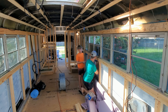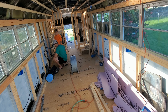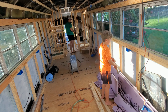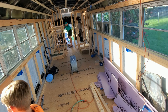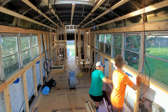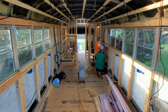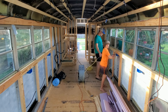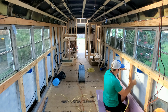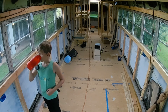So here we are day one — we're roughing in these electric boxes, running them every other window at about a 48-inch height above the floor. We have roughly five plugs on each of these circuits, which should be fine — we're running 12-gauge wire, so pretty thick. We're fishing them through voids we have in the framing on the walls. We actually cut some tubing and anywhere the wire penetrated the metal frame we would slide a sleeve of that tubing over it so that any friction there wouldn't be a problem.